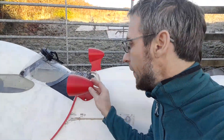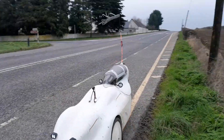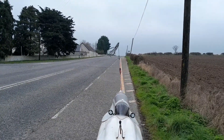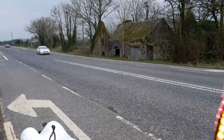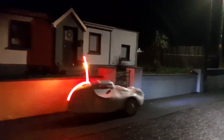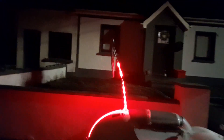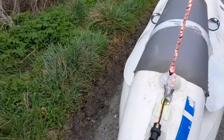I also added mirrors. Why is it necessary? If you've ever used a velomobile, you've probably had someone — maybe the police or a concerned citizen — tell you that you're not visible enough on the road and that you need to attach a flag. I used to ride with a large flag for quite a while. I attached a bright orange 12-volt beacon to it, the kind usually used on tractors. I cut the flag strips out of reflective fabric from old clothing, which greatly increased my visibility on the road. However, when I measured my energy consumption with and without the flag, I found that I was losing about 20 watts.